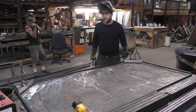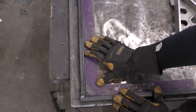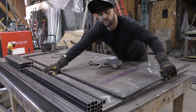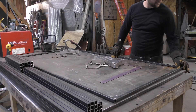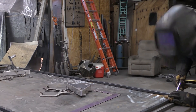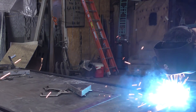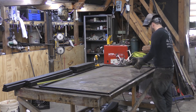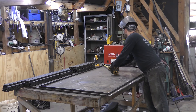These clamps are great — you just clamp them in, they hold everything square and it stays square. I think it's just the mass of them and how well they're made. Flip the piece around, weld on the other side, and we have a perfectly good rectangle which is square and nice, but we will check it with the tape measure corner to corner to make sure it's right — and it was within a sixteenth of an inch.